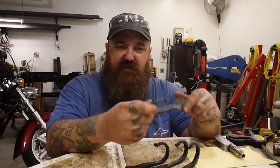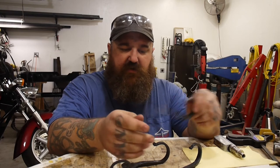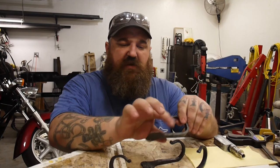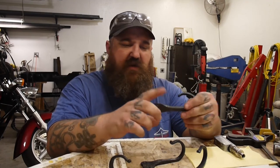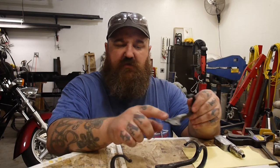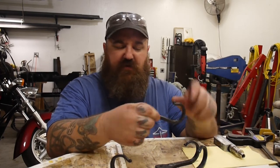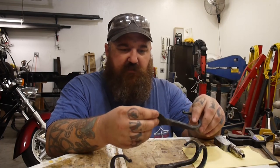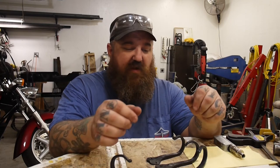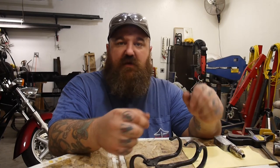I was trying to do this two-facet cloud on the top. This was the first one I did and I didn't really nail it, so I adjusted for the other ones. If you notice, I did the first two with the whole end completed first, and then I had no way to hang on to it. So when I did these, I just did a small flap first so I had something to hang on to, then tapered it out, did this part, then did the curl. I think that works a little bit better. It's all just practice — doing this more and more. I think I have a few more to make for my friend, and then I can get started on something else.